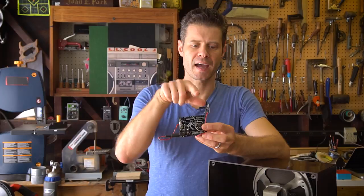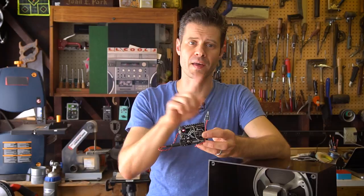Here's a little demo I put together on a separate Adafruit Metro Express M0, and in this case I have the Hall effect sensor plugged into a digital input pin, ground and power, and then I have a 10k resistor running between the power pin and the data pin.